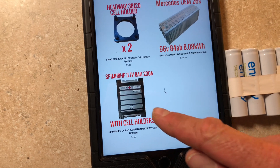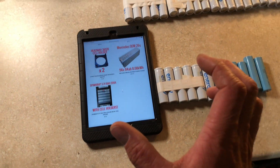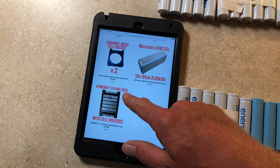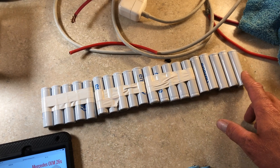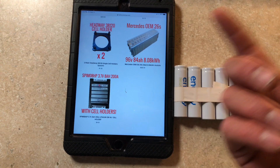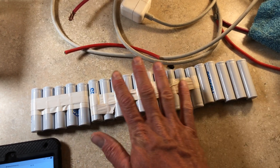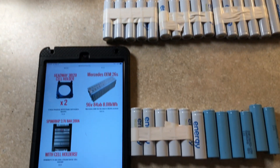We ordered the first batch of these to achieve the final voltage we're going to have in the quad, and that is a 20-cell setup — so we ordered 20 of these. We should be able to do 200 amps at the voltage from 20 cells. You just take 3.7 and multiply it by 20 to get the nominal pack voltage. That'll be our final-voltage battery pack.